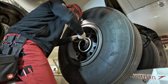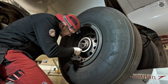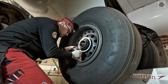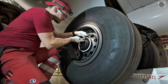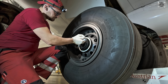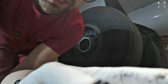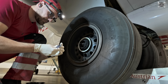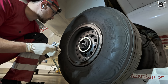Airbus chose to have dual safety on the cotter pins — you have self-locking nuts on those bolts and they are also secured with a cotter pin, which is really interesting. The nuts holding the wheel have a plastic section inside responsible for the locking function. Every time you need to install new ones because you basically destroy the plastic, so we'll install new ones after.